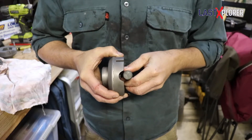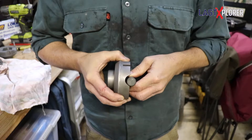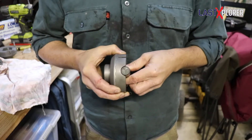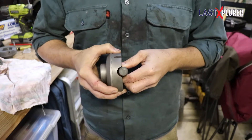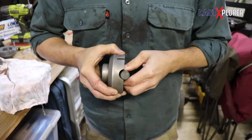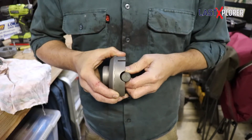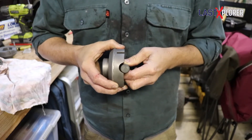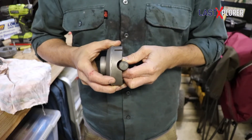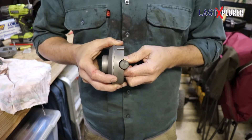There are actually minuscule spaces, but I'll over-exaggerate the space for the demonstration. The drive pinion sits up against there like that. Because of the shape of the drive gear, the turning motion is trying to push that mechanism out. That's what creates your outward force that acts against those springs we saw earlier. So when you've got drive into the locker, everything's all locked up and the springs can't push back. How it unlocks is when the outer wheel starts turning faster than the drive pinion — that space now changes. When it all gets unloaded, the locker can now move in and out against the drive pinion and against those springs.